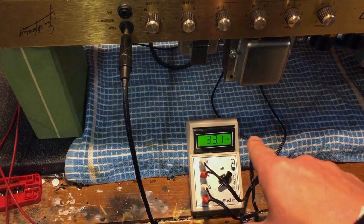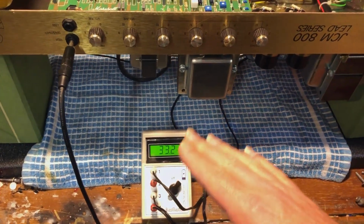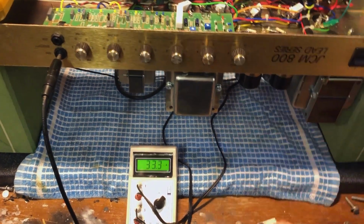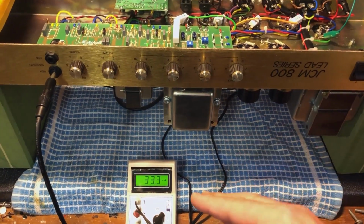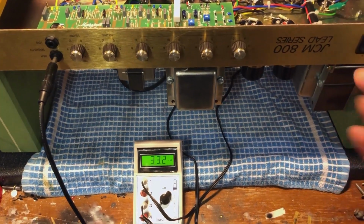These are set at about 62-63% dissipation for idle. You know me, conservative, well, only in respect to amplifiers. So if the voltage goes up or anything, we've got plenty of room to play with, and a good hot stage. It's great, it's perfect. Very happy.